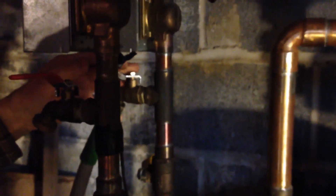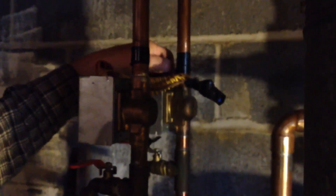In order to bleed the system, Mark's gonna show me how. So what do we do first? You shut the valve below the drain valve. Then you open the drain valve. And you open the zone valve. You hear it coming up?